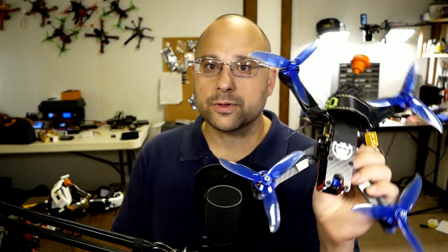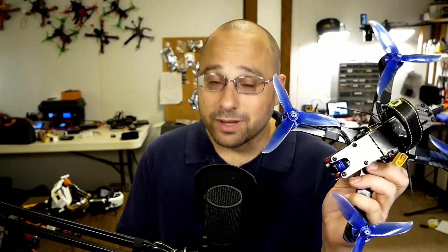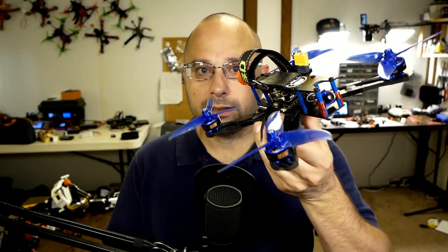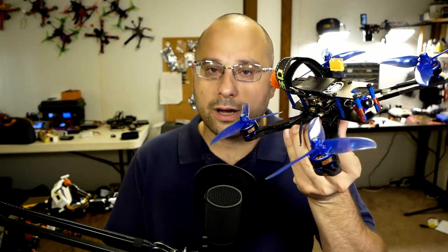What is the angle flag? The Betaflight devs know that it would be a real disaster if your quadcopter were to arm itself when you were carrying it around, so they've built in what they call small angle protection. This actually goes back through Cleanflight, Baseflight, probably even MultiWii. The way it works is: if the quad is not level, the quad will refuse to arm.